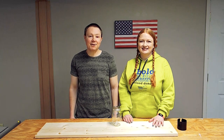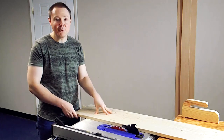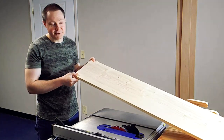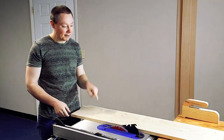We'll head on over to the table saw and get started. Since the depth of our jar holder will be four and a half inches from front to back, the most economical way to do this is to use a one-by-ten so you can get two four-and-a-half-inch boards out of it. That's our first step — to split this in half.